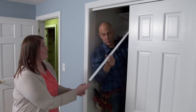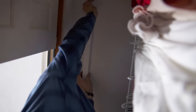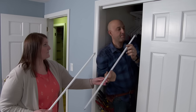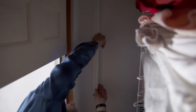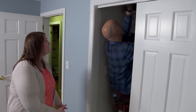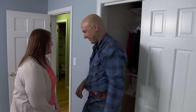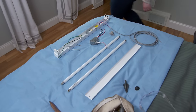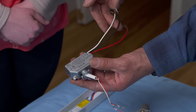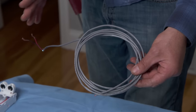Alright Ashley, I'll take that cover — thank you. And the lamps. It's ready. Here in the guest room, I have a different component I want to add to your light — it's this transformer switch, which takes the line voltage, 120 volts, and switches it over to low voltage. Because it's low voltage, it gives me a lot of flexibility to put the switch wherever I want, and with no electrical box. Sounds good.